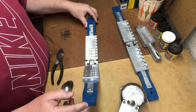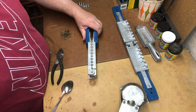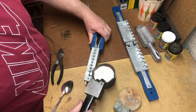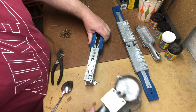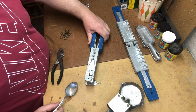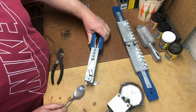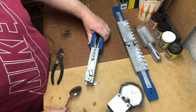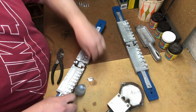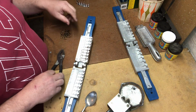So I went ahead and put 4 more hooks in. We'll close the jig. It's closed and all these ports are wide open, ready to go. So let's pour another quick hot bead all the way across. And you can see I didn't worry about being real clean with it or being real precise with the pour. I just wanted to get it across there as fast as possible. The faster you go, that lead will stay hot and make it all the way down into the mold itself, and that's why I was able to pour these jigs without having a defect on the first run.